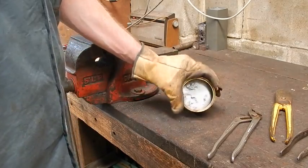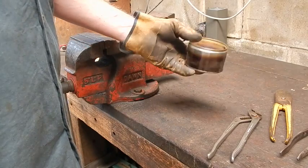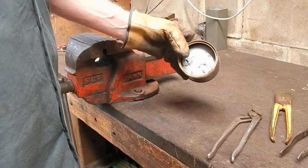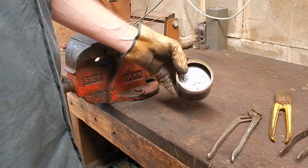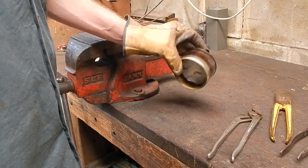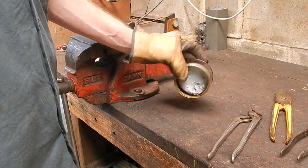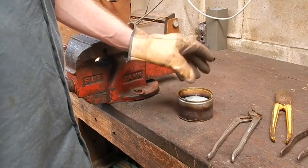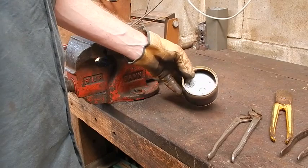There's a bit of aluminum in the tin. I just cool it down the last little bit with the hose. You never want to get molten aluminum anywhere near water, but when it's cooled down the last little bit, it doesn't hurt to put the hose on it — that will just help it separate from the tin. Make sure it's three quarters cooled down. Definitely do not do it when it's red hot.